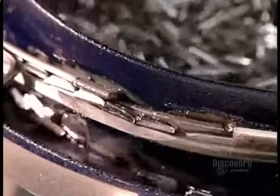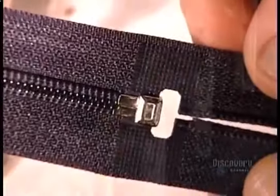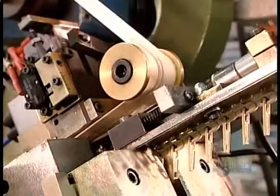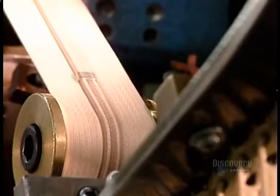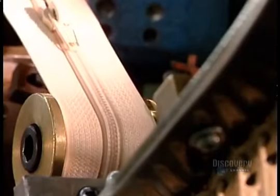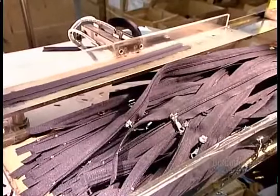The pin is that vertical piece of metal on one half of the zipper that you have to align in the box on the other half before you can pull the slider to zip up. The next machine installs the slider — watch in slow motion as it opens each gap and hooks a slider onto the track of teeth. The next machine inserts the top stop — a thick piece of flat wire that stops the slider at the top of the track when you zip up all the way. The machine then slices the tape at each gap, separating the finished zippers.